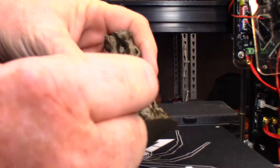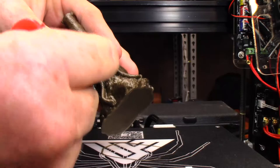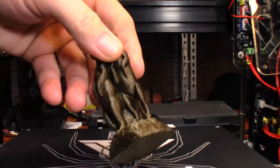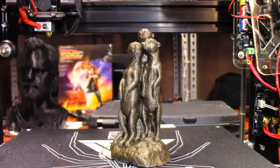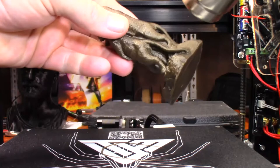This looks like a little loose piece there — I want to get rid of it as best I can. That one actually looks like it printed in place; I think it was part of the model. Anyway, it's usually best to just take a screwdriver or something and knock off some of the hairs. Then what you do is take your heat gun — I've got a Drill Master, the cheapest one from Harbor Freight. Just turn it on low and it will take all the little wisps away from the print pretty easily. Cleans it right up.